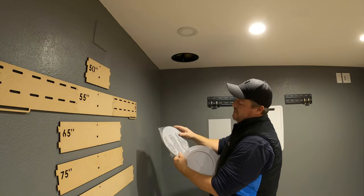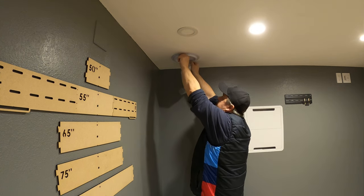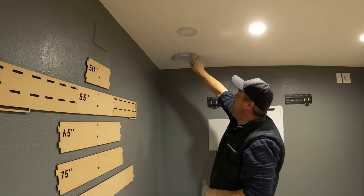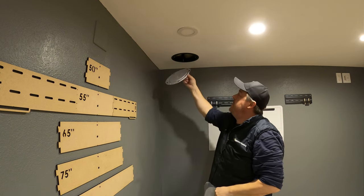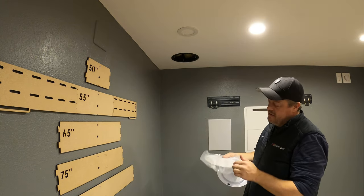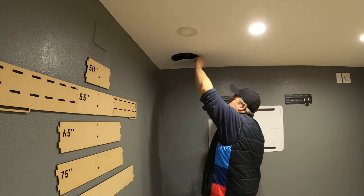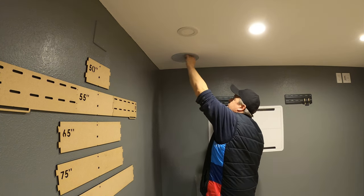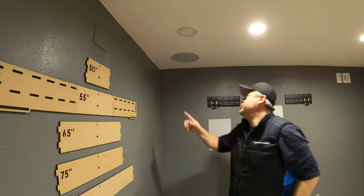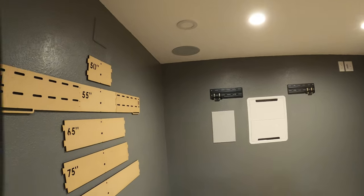You've got two methods here. If you're going to paint these speaker grills, you can spray paint them, but you're having your contractors still come in to do the paint shield so they can paint right around here without getting any paint inside or having dust drop down for the painters. In our case, we're going to put a grill on — nice finished-looking speaker. If you look up at it, you can't tell there's no speaker in there, because we're using the pro rough-in bracket. Taking the camera right up to it — you cannot see through the back.